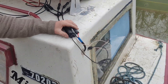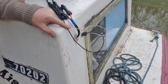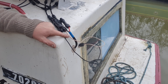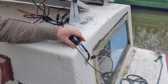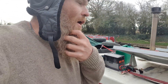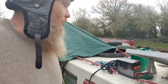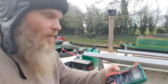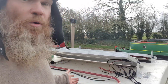I'll just give you a demo. The bottom two leads — the beige and the black, which used to be red — are my original cables going to my original battery, or what I call Battery A. I thought wiring the same cable up exactly the same way would give me the same polarity, but that was incorrect. I had to do a butt splice downstairs, expose the wires, flip the polarity, and then get the soldering iron out and solder the joints up. Now I've got both cables wired correctly, checking with my multimeter to make sure everything's right.